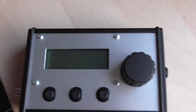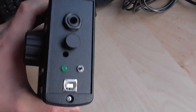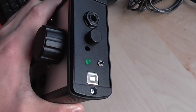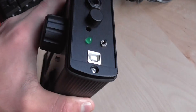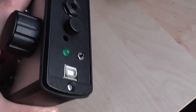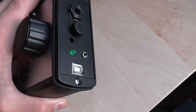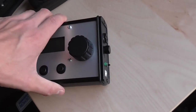I've got a 4x20 LCD. Here we've got a Morse key input, a power switch, and a little hole for the side-tone speaker. I've got a charging LED, a USB interface for serial communication and programming, and a programming button that you have to hold down for it to program — otherwise it only acts as a regular serial connection.